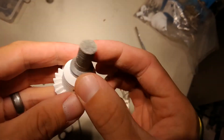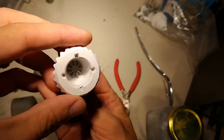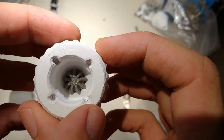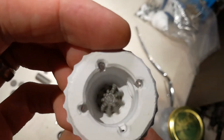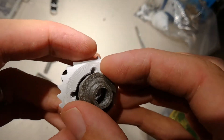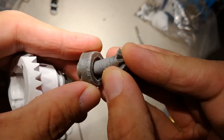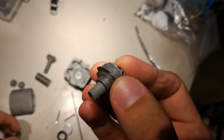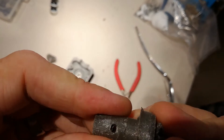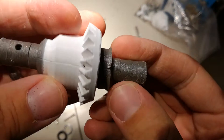This is the carrier. You can see it prints in this orientation so it prints with zero supports. This piece is separate — I've actually press-fitted it in there already and it's kind of stuck so I'm not going to take it out. Here you can see one of the side gears inside the carrier, it's already installed. On the other side, which will pop in here, you can see the bearing that sits there. You take one of the side gears that just slots in there like that. There's a little piece here which will pop on the back and we can put a grub screw through there to hold it all in place.